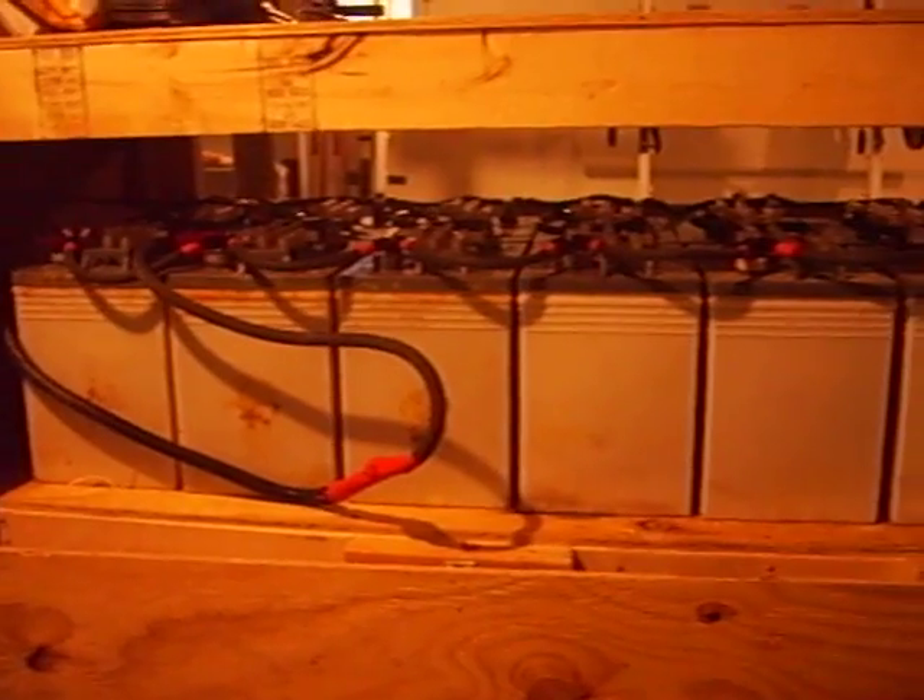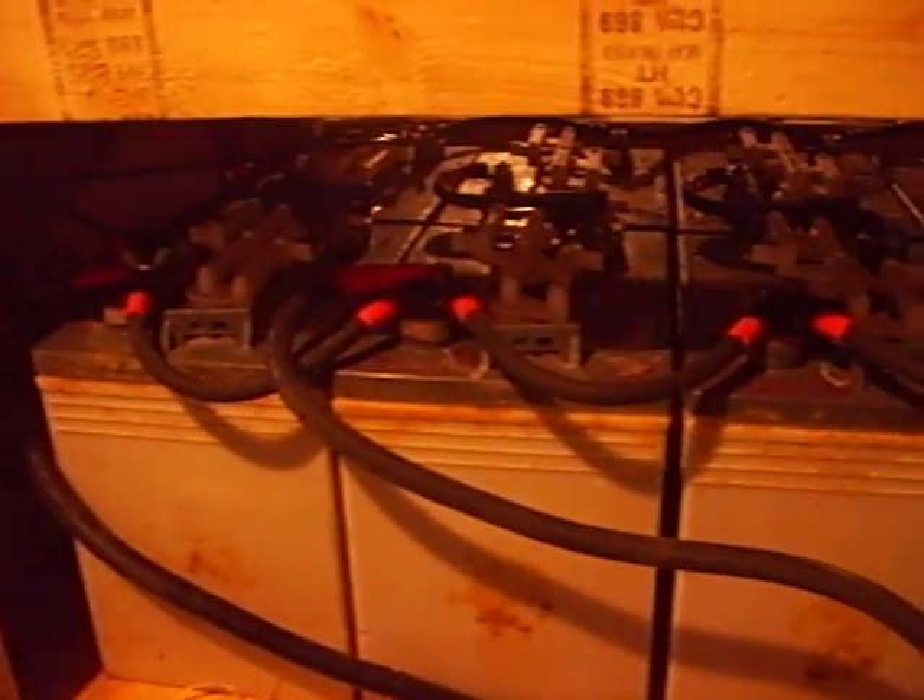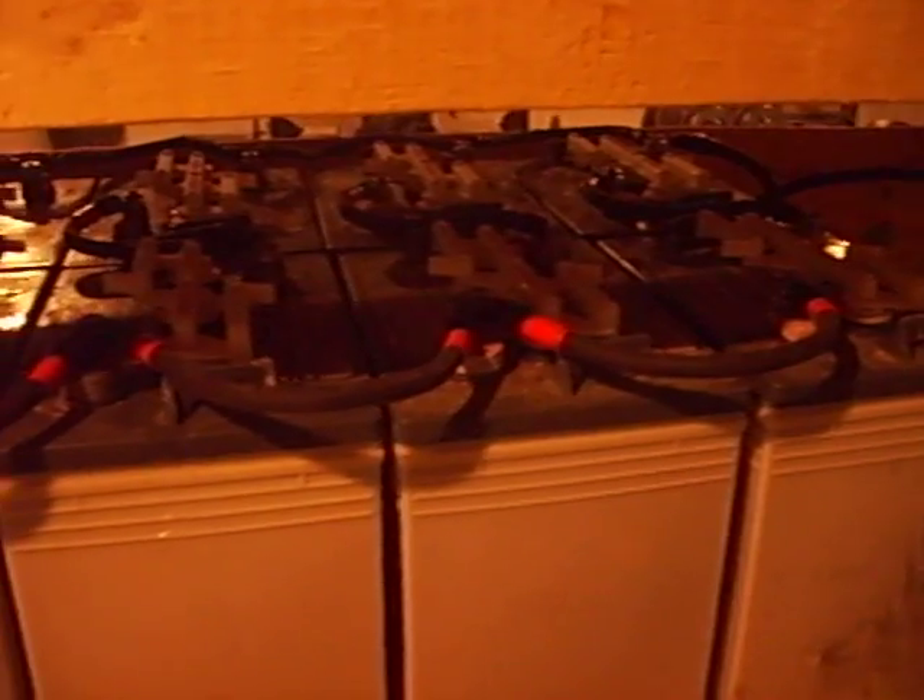It tests out at about 90 percent. I made all my cables — I bought number two welding cable, bought my lugs, crimped them, and soldered them. It cost me about 50 bucks to make them. If you buy them pre-made, they're 250 to 300 dollars, so you save a lot.